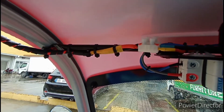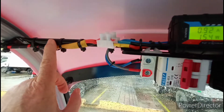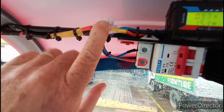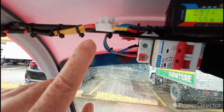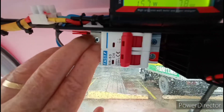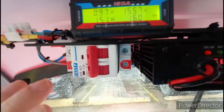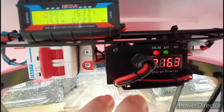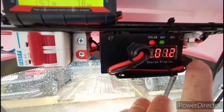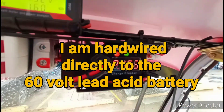Another thought — this thing looks very complicated, but it really isn't. This wire is coming from the solar panel, it's a 12-gauge, and I looped it through this meter, it just loops through. So it's actually coming in a straight line, then it hits the 16-amp circuit breaker. It's a fast-blow circuit breaker for solar panels, for safety. And then it goes into this controller, and the wiring for the controller is like 17-gauge, so I went with 17-gauge for the battery.